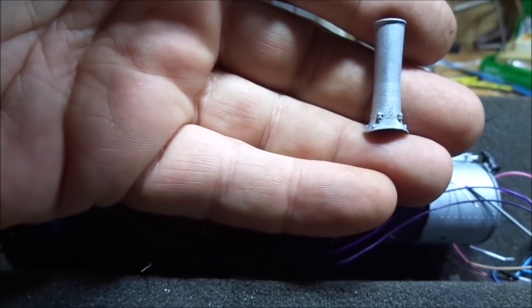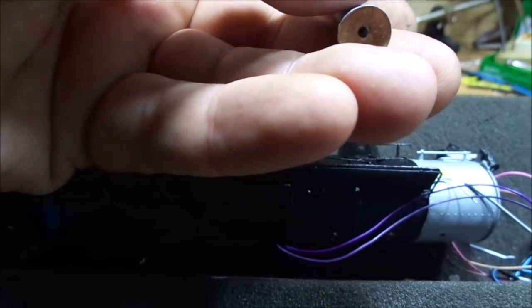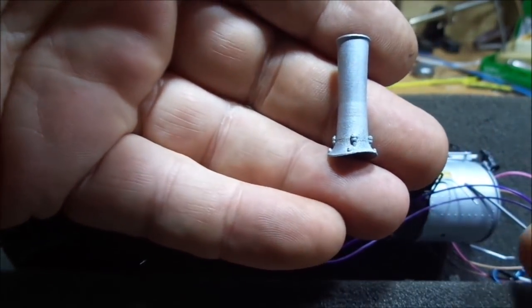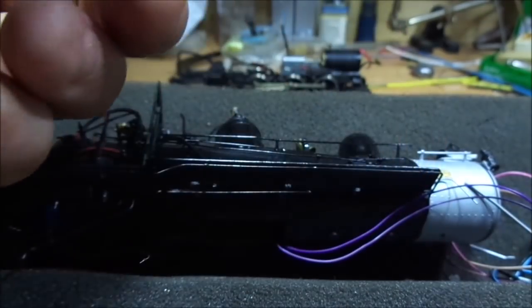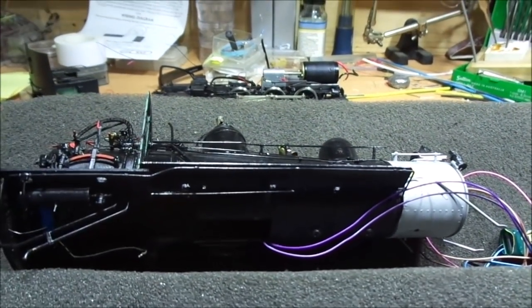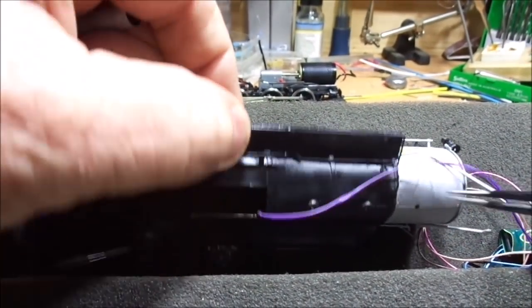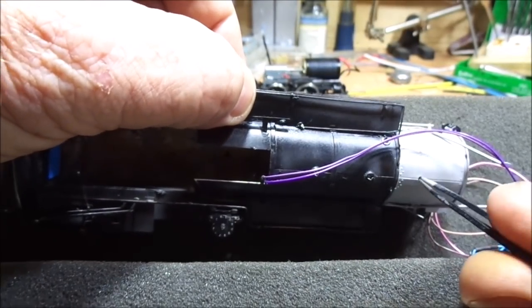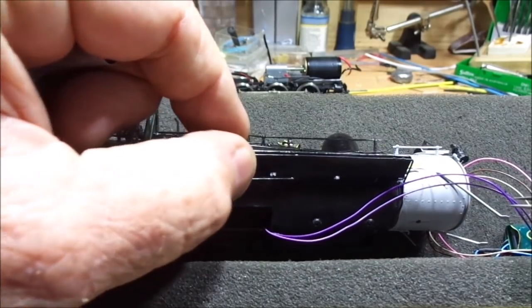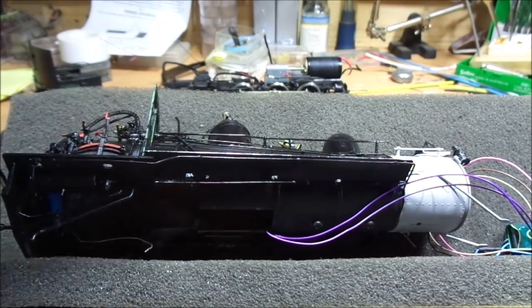Removing the waste lug — I had to take the screw out holding the smoke stack, and that also helped me get the speaker inside the front of the smokebox. I can put that in there later. This screw going up in here is going to clear the speaker, so it's important to check that your speaker has got the clearance on it there.